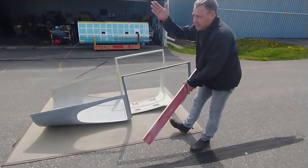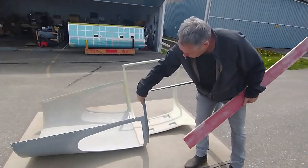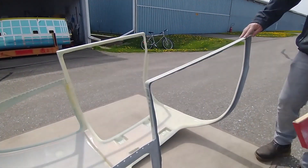Continually we measure back and forth to see if it's going to fit in the opening in the fuselage. Just a word of advice — be very careful. This area becomes razor sharp after it's been sanded and you will cut your fingers on it, so be very, very careful. Use gloves whenever you can.